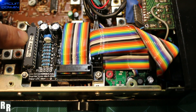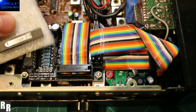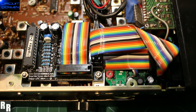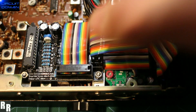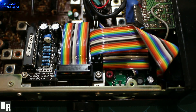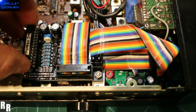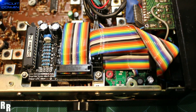Upgrading from version 2.5 up to the latest version 2.6 from the Digimax. If you have a version 2.5 with hardware version 2.7 or greater, all you really have to do is just switch this MCU — update plug and play, just straight in. Simply remove the old MCU carefully, take that out, and replace it with the updated version which now supports 5KC — simply plug and play.